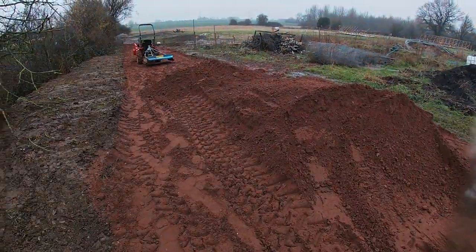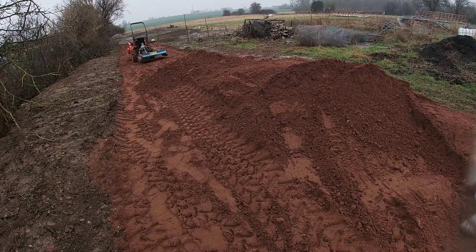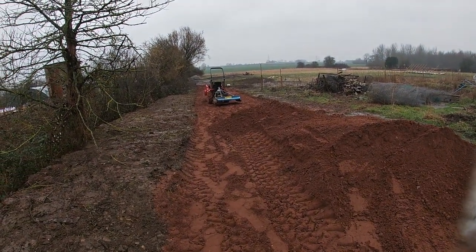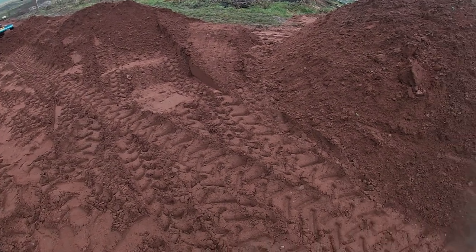For the first part of this track I'll need to fill in this hogging all the way down to where I'm putting a little culvert in. It's a rare thing to have a culvert in the middle of a track like I have. Then once we've got all this in position, a layer of geotextile membrane over the top and then a finishing coat of roadstone, so it's a drivable surface all year round.